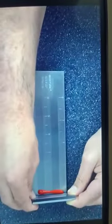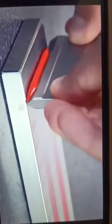Now, pull the scraper along the length of the gauge at a constant speed, applying downward pressure as you do to push any excess material to the edges of the gauge. Stop the pull at a point beyond the zero depth on the gauge, ensuring your sample has been scraped over the entire length of the channel or channels.